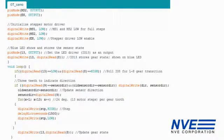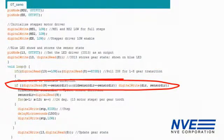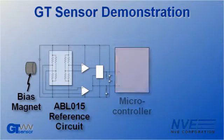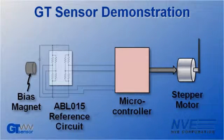Here's the Arduino program for the clock motor servo. We poll for a transition in the speed signal, which indicates a gear tooth. The gear has 15 teeth, so we move the motor 24 degrees per gear tooth in the direction indicated by the sensor to follow the gear. We don't need the flip-flop if we're using a micro — we can just sample the unlatched output. And we probably wouldn't even need the comparator, since there's enough signal to run the sensor outputs directly into the controller analog inputs.